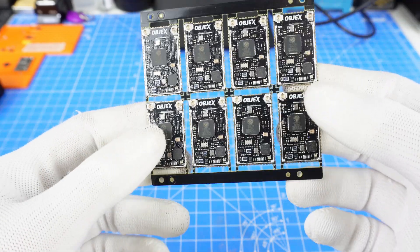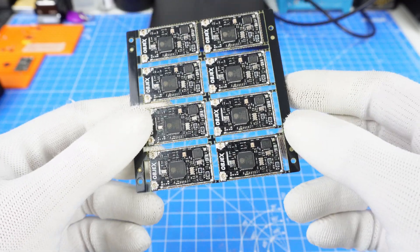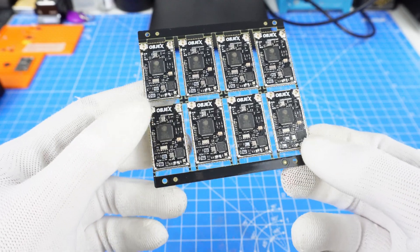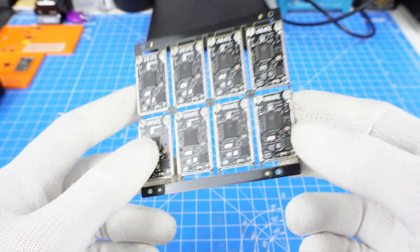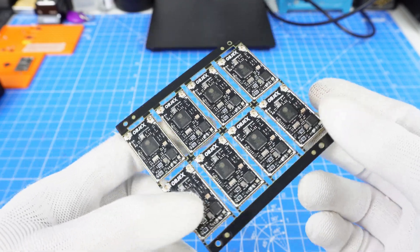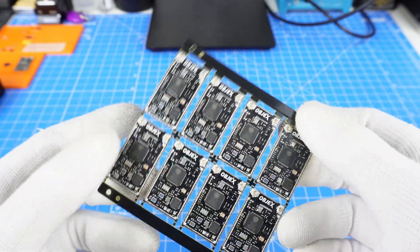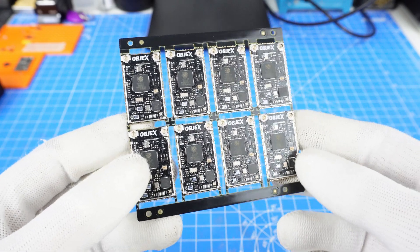A panel is made up of about 557 components, many of which are 0201 resistors and capacitors. Placing them one by one and making sure they are all properly positioned on the PCB is extremely complicated. The Neoden pick and place machine is definitely helping me a lot. As for everything else, the oven and the stencil machine are currently working properly after successful calibration.